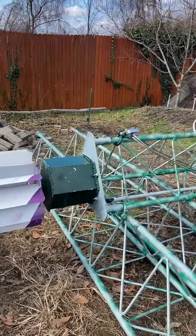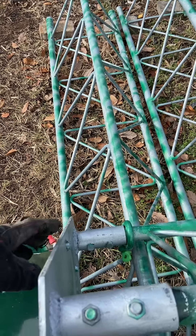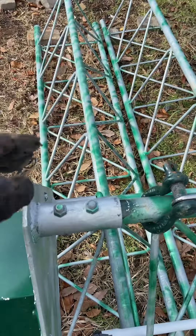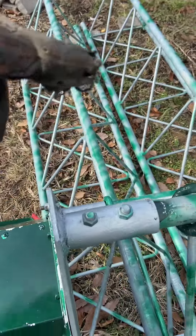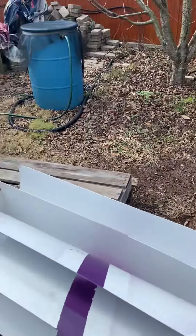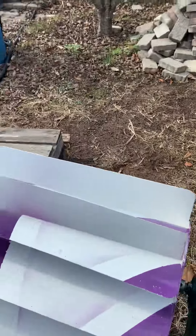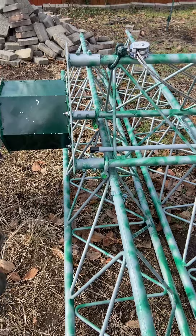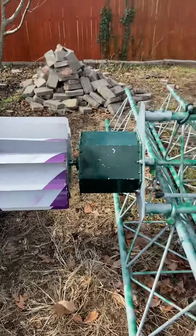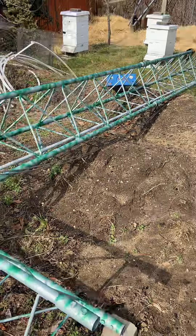You guys can give me suggestions, but this is the north side so all the winds come from the east, southeast, and southwest. I'm going to put an aluminum bar attached here, have it come out past the turbine's diameter, then go 90 degrees straight up and sit a foot or so above the turbine. The only thing in its way will be the small pole itself. I saw people put it lower, but lower gets blocked by the structure so you're not getting a pure wind reading. I'll show you some stick welding with aluminum — I've been watching and trying to pick that up.